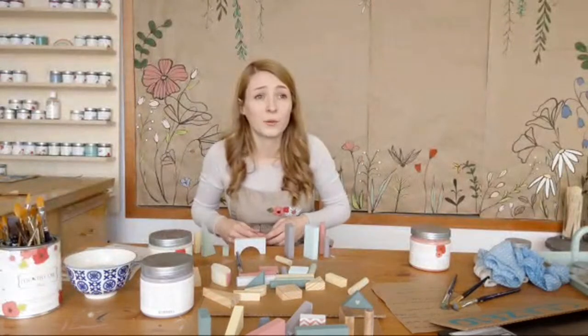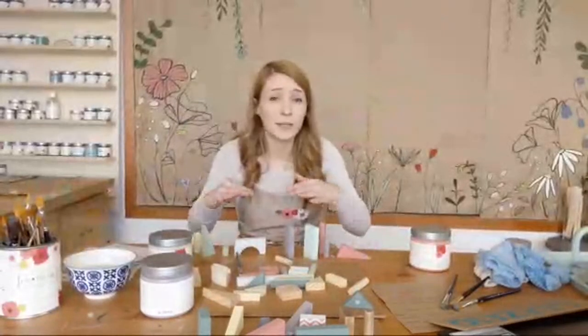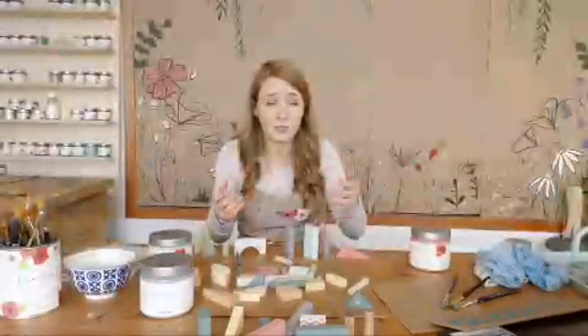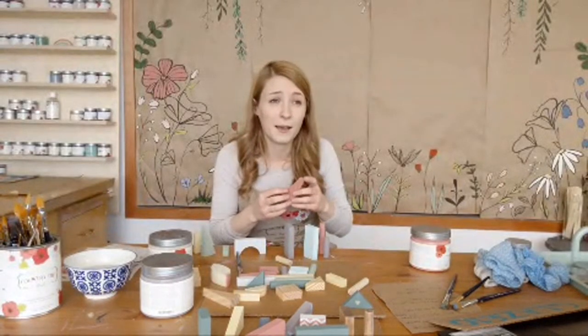I think in the woodworking world they usually use linseed or Danish oil, but this is a great alternative as well. It does take a bit of time to cure, about 4 weeks. That's all happening under the surface. You can still gently use a piece or these after a day or two. But these, hemp oil does need a few hours to absorb the first time.